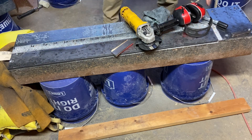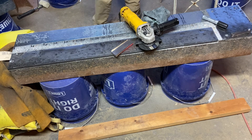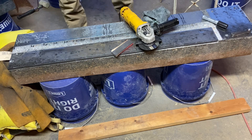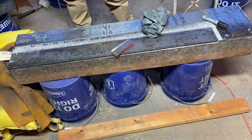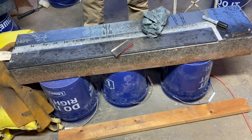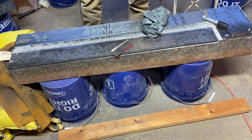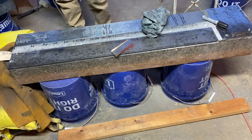The surface plate has not started feeling any lighter from the hundreds of times I've lifted it, but we're almost done here. For the second rail, I'm going to attach the first rail fully and then use a dial indicator — and maybe the straight edge — because I know it's going to want to sink into little tiny low spots and not give a super consistent reading. I shouldn't need to do the exact same surface plate process a second time, or at least I don't think so.